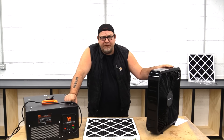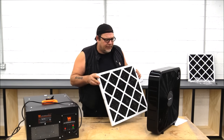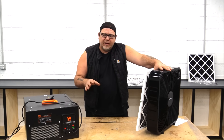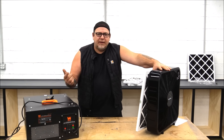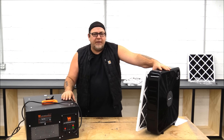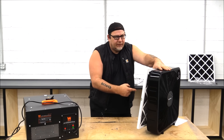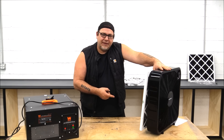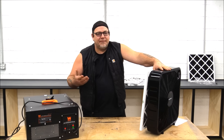All the box fans I have have run for a very long time. So again — cheaper, plenty of longevity, super simple, and more CFMs. Let's talk CFMs for a minute. If you're in a 20-by-20-foot garage, that's 400 square feet. With 8-foot ceilings, it's 3,200 cubic feet of air. The traditional unit at 400 CFM would take about eight minutes to clear the air in your shop. The box fan setup would do it faster than that. And if you had two box fans, you could clear the air every two and a half to three minutes. If you have three of them, you get the gist.